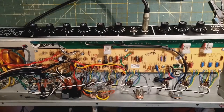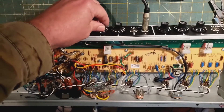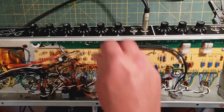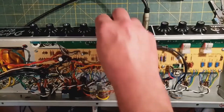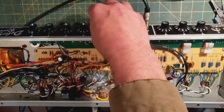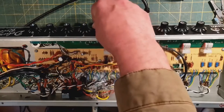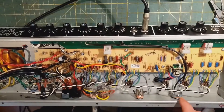I don't have the reverb tank hooked up right now; the tremolo is working but I don't have the footswitch hooked up. Even without the bright cap, the channel gets nice and spanky if you want it to. If you really turn the mids down and bring bass and treble up, you emphasize that scoop — sounds very '80s clean if you want it. I'm pleased with this little five-dollar addition.